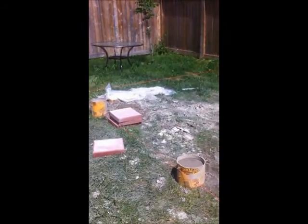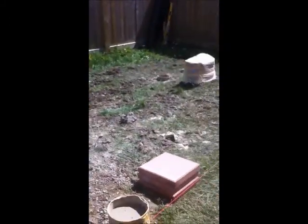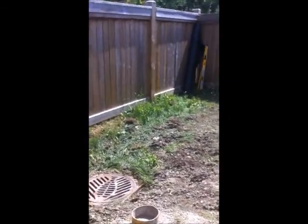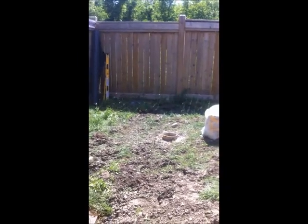The sono tubes have gone down four feet below frost level so that they don't heave. You can see along the front here we've got three footings for the front of the deck to carry a main beam, and there are two in the middle that will have a beam underneath to help stop any bounce in the deck.